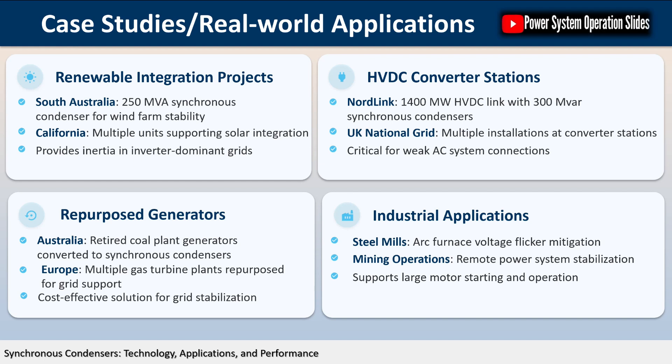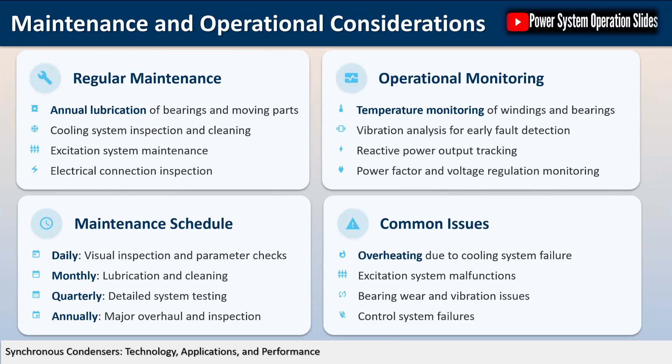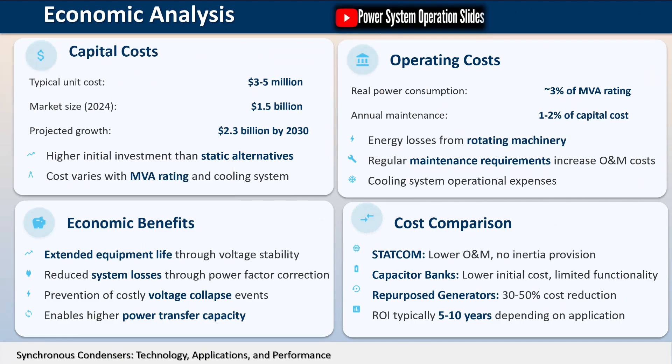These units are available in various sizes, typically from 100 kVA to 10,000 kVA modules, with voltage ratings from 480 volts up to 15 kV. Many units now feature PLC-based controllers with integrated power factor controllers and regulators that allow the system to be set to meet a given power factor or to produce a specified amount of reactive power. These systems often include state-of-the-art integrated touchscreen displays and control interfaces designed to be user-friendly and easily understood.